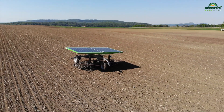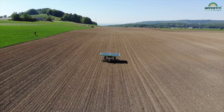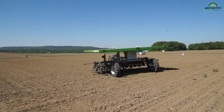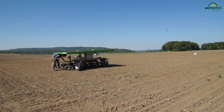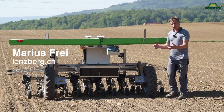The kind of slope we have here is almost the maximum possible at present. At maximum capacity, the machine can weed this two-hectare field in ten hours. As equipped here, the machine costs around 80,000 Swiss francs and allows for the cultivation of a maximum of 20 hectares. It takes about a week to sow 20 hectares of sugar beet, and after that weeding must start straight away.